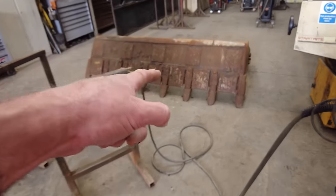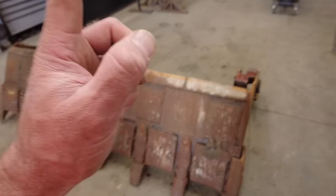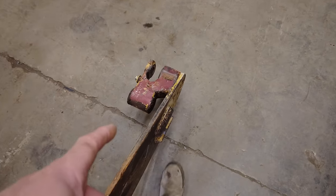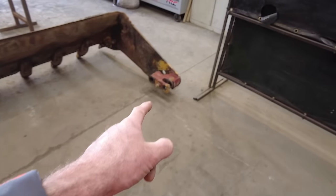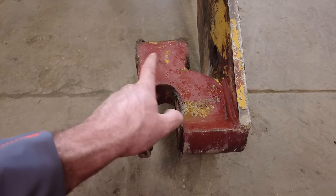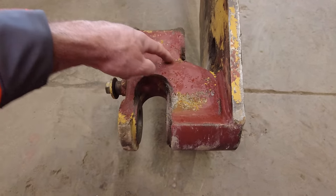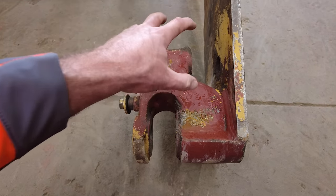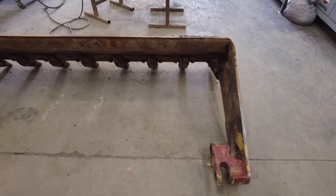And this is off the 953D, which we'll go into more detail after, as the hanger brackets have. Well, one of the hanger brackets, should I say, has cracked again on the opposite side. I think it's this one. So I'm thinking gouge it out again, re-weld it using a different weld procedure and maybe plate it, but I'll just have to check to see how close we are on the machine on the other side of the bucket. See if we see that little crack there. Oh, there's a bigger crack than that on the other side.